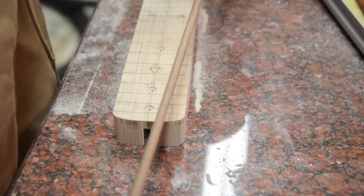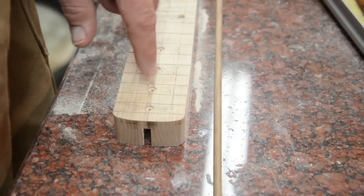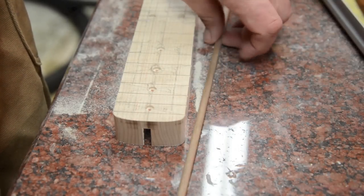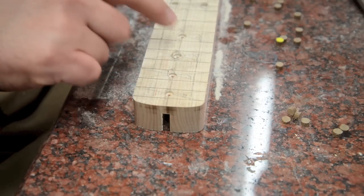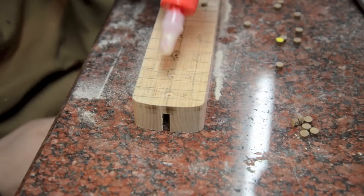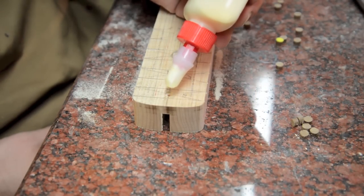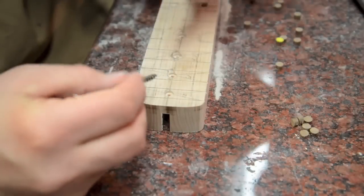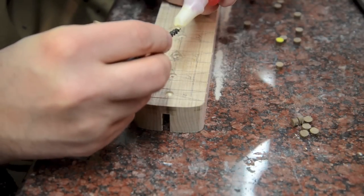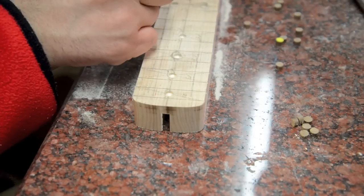Next, I'm going to insert the walnut inlays. I've got a 1/4 inch dowel rod of walnut and I'm just going to cut it up into small 1/4 inch pieces and then glue them in. I'll take this to my bandsaw and cut that up. So next I'm going to insert the keys — I've got all these cut up. I take a dab of glue, make sure there's no dust from where I slotted in, and just a little bit of a dab. I use a screw to get a controlled amount — it's just a drop of glue, and even a drop might be too much.